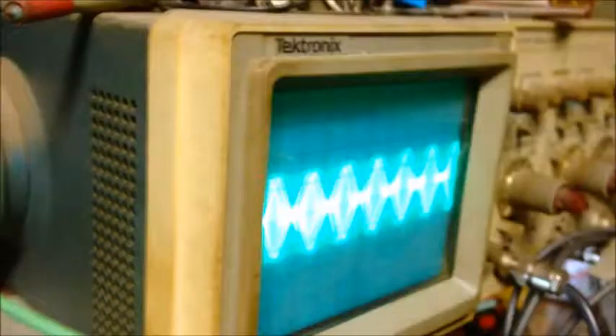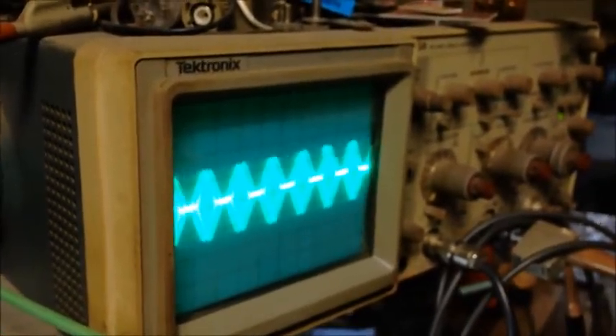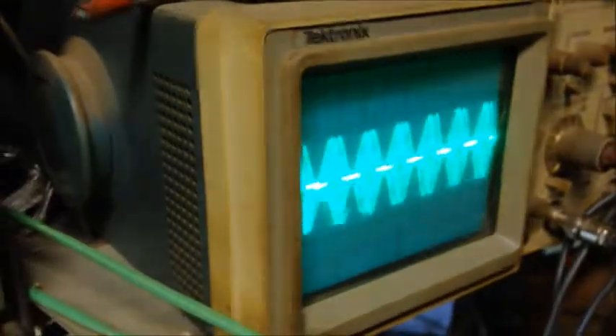Still squaring even almost all the way off. Now by adjusting the mic gain — see, that looks good there, which is fine. But look at the negatives — they're all flat across. No curvature there, and it's only 50 percent modulation. Not good at all. These radios probably really didn't sound good. Once I start getting anything over about 80 percent, the negatives still look like crap, flattened across. The positives are round but it's only 80 percent modulation — not good at all.